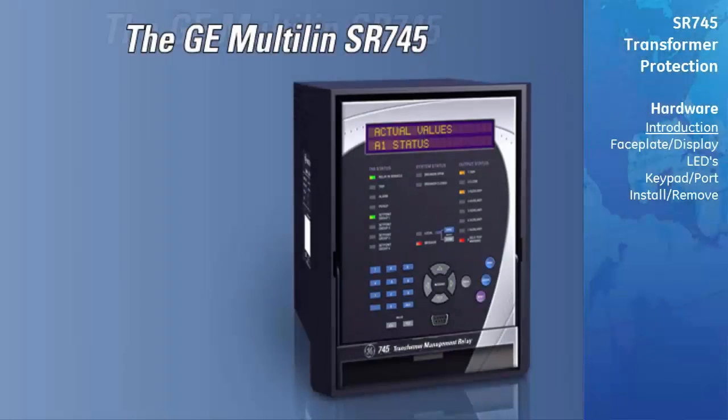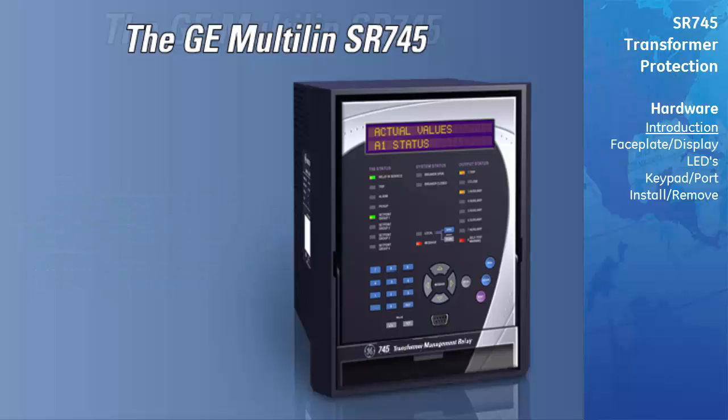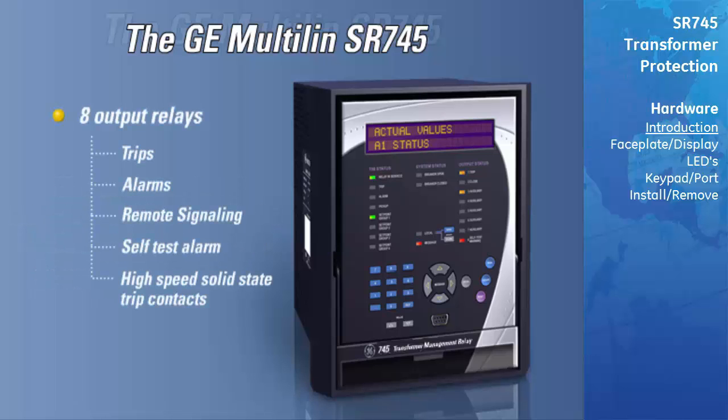The SR745 Transformer Management Relay is a microprocessor-based relay designed for the protection and management of 2- and 3-winding transformers. It is equipped with 8 output relays that can be user-configured for trips, alarms, and control functions, as well as dedicated self-test alarm and high-speed solid-state trip contacts.